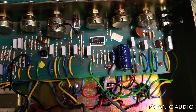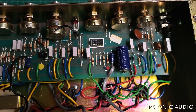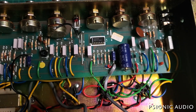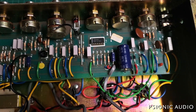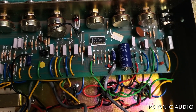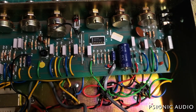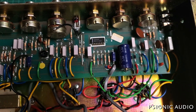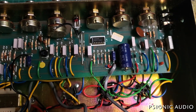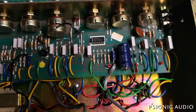Yeah, that's not right. Let me put it in standby and pull V3 since it's acting so ugly. That is an old GE 12AX7 — great tubes when they work, but like any tube they eventually stop working. I've got a TAD handy — that'll be fine. Let me put it in and see what happens. I'm ready to turn the master volume down if necessary.